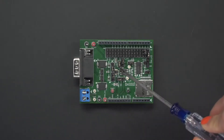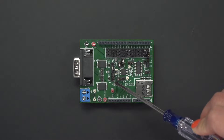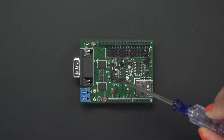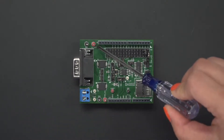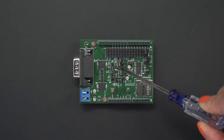I'm going to go through all the jumper settings, and you can reference the jumpers on your screen. First off, we have the TVS diodes rated at 30 volts. Our load, which we've set to 60 ohm, has another option to set it to 120-ohm split-V termination. By removing the jumpers, you will have no load, so you can have more than two nodes in your network. Next, we have our supply, VDD and our VL supply. They're both connected to the external supply connected to the VDD external test point and the VL external test point. JU3 is mainly for measuring the logic current draw, so we'll keep it on.